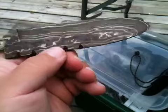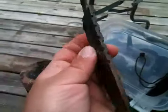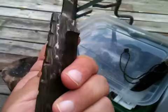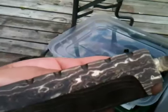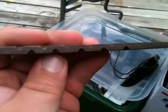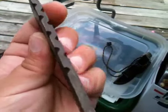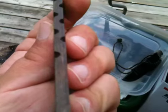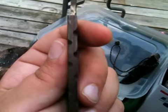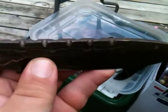All on 91W combat. This file work here is done with a chainsaw file. Your Kershaw looks good that you did with the Dremel, but I think you'd have better luck with a chainsaw file — that's the way most of the custom knife guys do it. You could also do a little triangle file in between and end up with this sort of vine pattern. The chainsaw files cut real well.